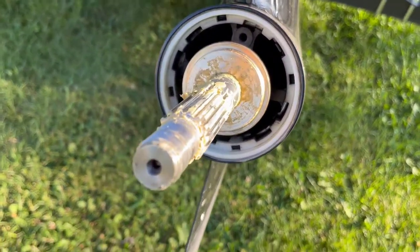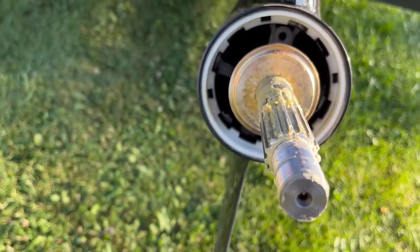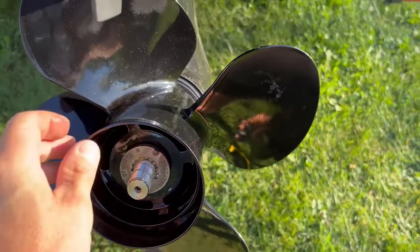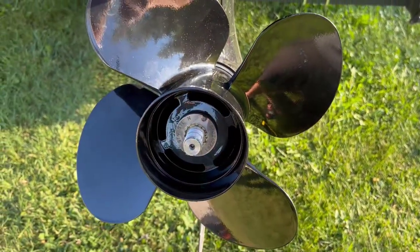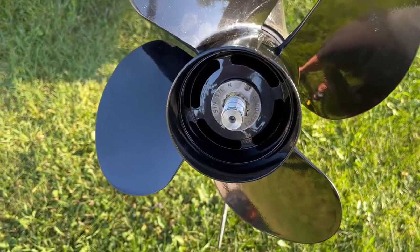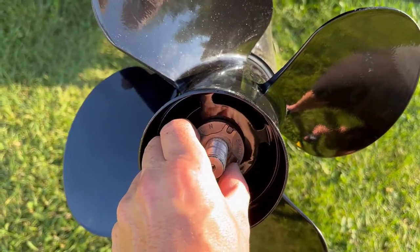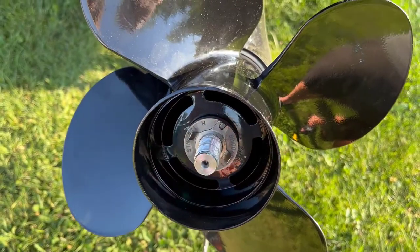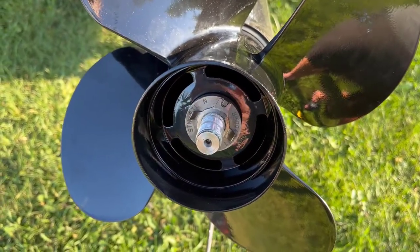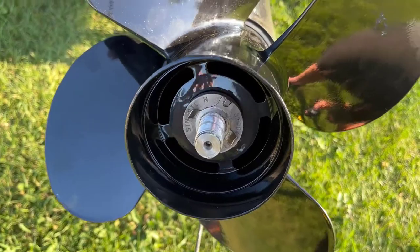I'm going to give the shaft a little cleanup and apply some new marine grease, but in all honesty it's probably fine — there's no goop or gunk, just grease on there. We're going to slide this on, it's now on and in place. Remember to put the locking adapter on first — a locking adapter is super important. While in drive nothing will happen because the prop is constantly pushing itself into the motor, but as soon as you put it in reverse, if you don't have this locking adapter to hold that nut in place, the prop can spin itself off. If you don't have the locking adapter on and you put it in reverse at the boat launch, you'll lose your prop in the first minute. So make sure the locking adapter goes on, then get your nut on there.